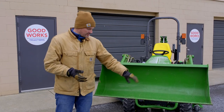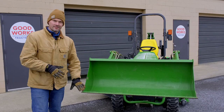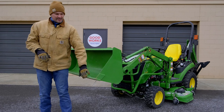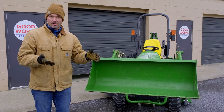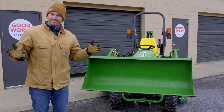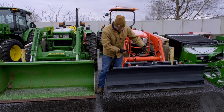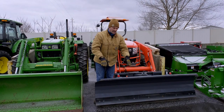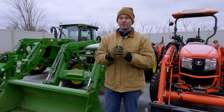Another consideration is the bottom edge of the bucket. Not only does it trap and hold material, but it's also intended to dig — dig down into a pile of dirt, gravel, mulch, or whatever material. As it rides along the plowing surface, it's naturally going to dig into that surface. If you have gravel, stone, asphalt, or concrete, catching any edges or loose stone could chip a surface, collect that stone, and put it somewhere you don't want it. Compare that to a plow, which has skid shoes underneath, or a snow pusher with skid runners on either end — these prevent the leading edge from digging into the ground. The intent is to glide along and follow the contour of the surface, take care of the snow, and move it where you want. That's very important to consider because it could end up costing you a lot of additional money repairing damaged surfaces down the road.